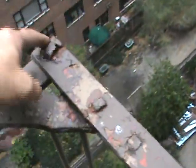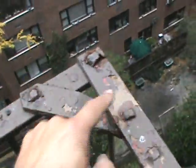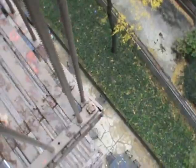A lot of these, as you can see, are gone. A lot more weather hits this. Corners are gone, see? So 100% of the corners got to be done. We've definitely got water trying to get in between the flats, so we got to clean all these flats, and you got to seal it so the water's not getting back inside these flats. You've got cement here that has popped some of these sills, and they've replaced them recently. All right, let's get to the other side.